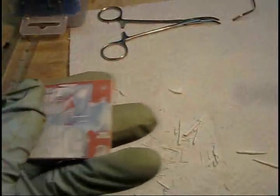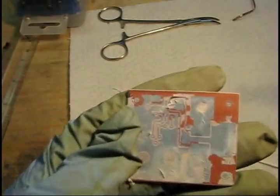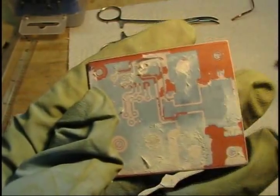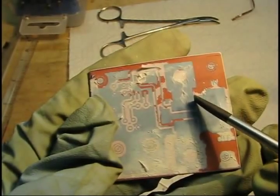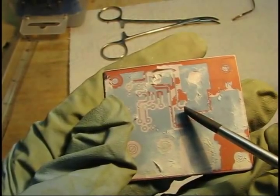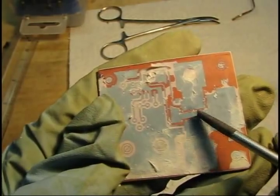It's actually pretty aggressive. People take their time and use all sorts of gentle babying methods, whereas I skip straight to the business. Areas that don't have any toner on them will start to flake away, and you'll see that some areas will have this white coating — that's not paper, that's actually the gloss coating. It will chip away with a little bit of effort. You want to get all the gloss coating away from these areas that are to be etched, otherwise you're going to have issues with the etchant actually getting down to the copper.